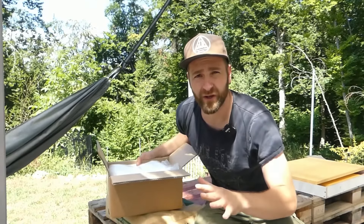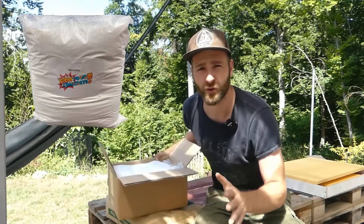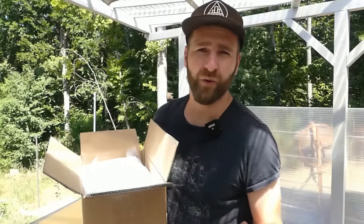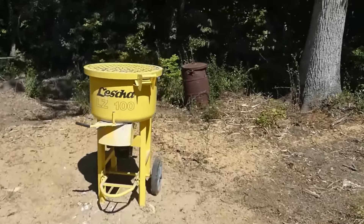We will need quite a bit of concrete for the kitchen — I have calculated that it will be around 400 kilos. The concrete I am using for the two countertops will also be mixed with microsilica. This is a very fine additive which makes the concrete even more durable and the surface even finer, so you get even smoother surfaces with it. One important note: if you are working with microsilica or other fine aggregates, wear a respirator, because this stuff is so fine that if you inhale it, it settles in your lungs and you don't want that. So let's get started with the concreting.